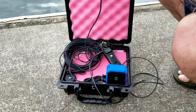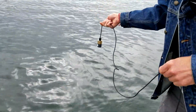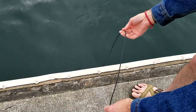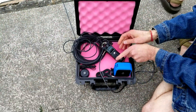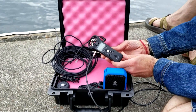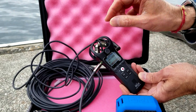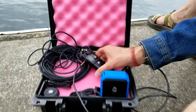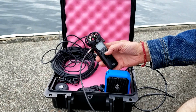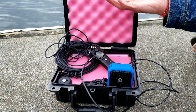Now we're going to put the hydrophone in the water. I'm going to increase the gain here with this dial — I can turn the gain up a little bit, turn it up to eight in this case. And now, if you hear some sounds you think are interesting, like those crackling sounds, I'll push the record button. I have this set for a five-second delay, which is optional. Now we're recording the underwater sounds.